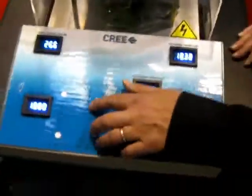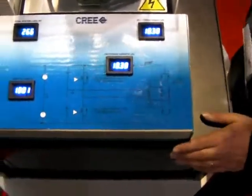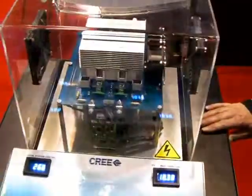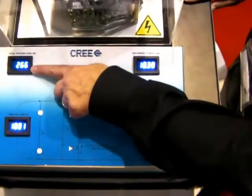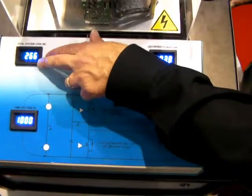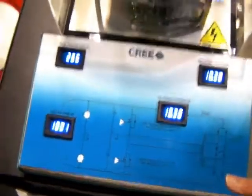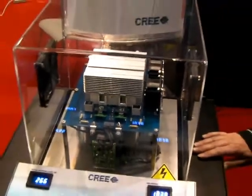As you can see here, 1,000 volts in, 10.38 amps DC fed back — total power delivered is 10.38 kW. The total input power, which is just the power coming from these two supplies, is 266 watts, and that's the total losses in the system — MOSFETs, magnetics, everything — and so that gives us about 97.5% efficiency.